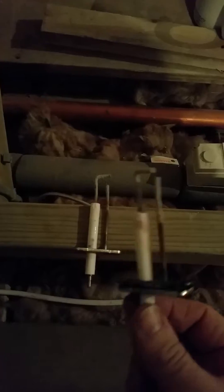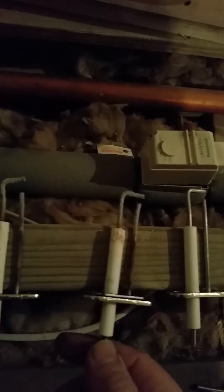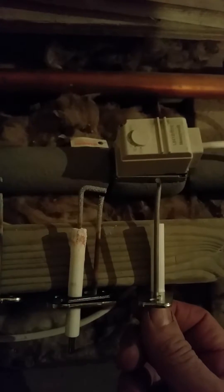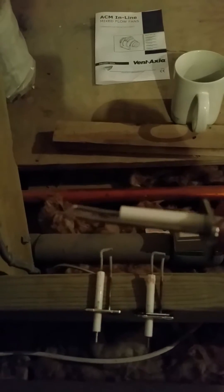Two boilers — this is the one that had F4 on it, and this is the one that didn't. This is a new probe. Here I've got one carefully bent to my left — bent very badly to my left. The new one bends to the right, so when it goes in the boiler it's actually bending up towards the burner. This one, that's been in a while, has started to bend away.